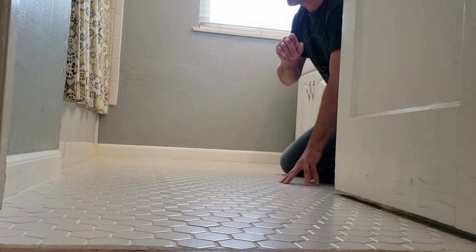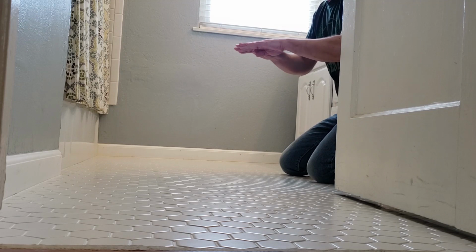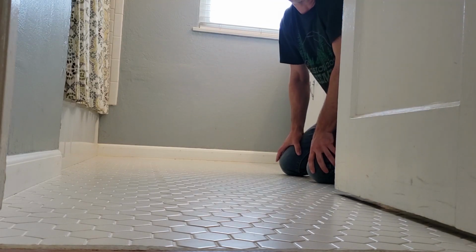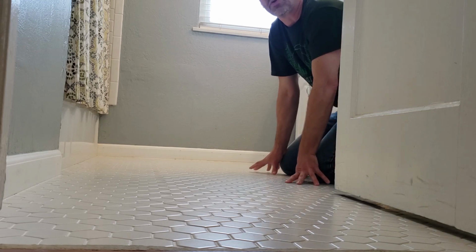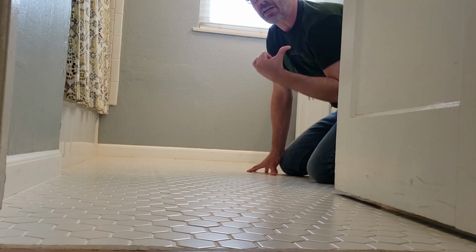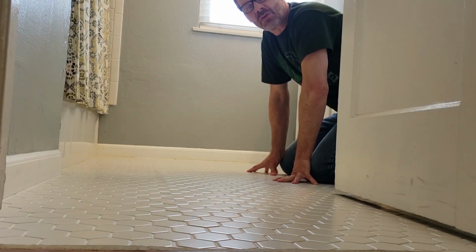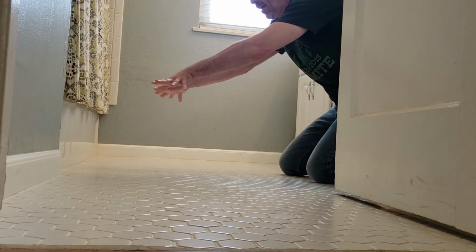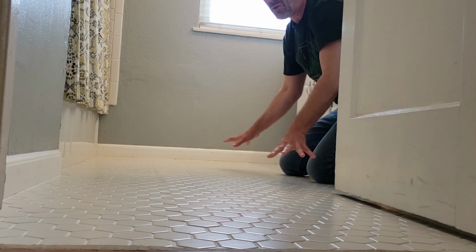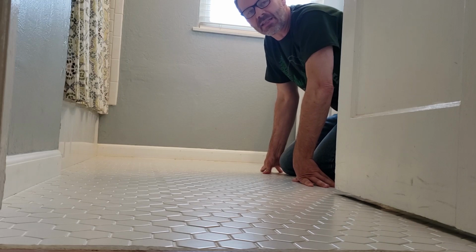I would like to add that I don't think I mentioned before that I had heard that you start with the tile along a seam that's most visible. So maybe that's when you're standing at the sink washing your hands, or maybe when you're sitting on the toilet. What you're looking at, you should start with that first so that you get that perfect. And then as the tiles come away from that, if you get a little imperfect away from that, it's okay. That's the best thing to do.